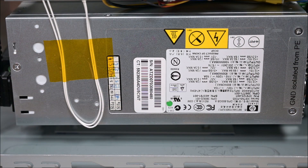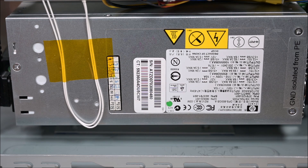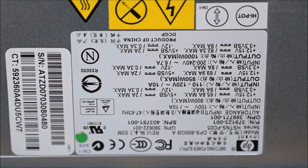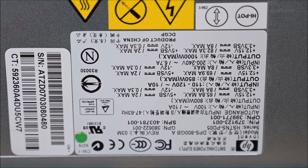The heart of this power unit is based on four HP server power supplies, each providing a bit over 12 volt and 82 amps, which is 4 kilowatt. Because the power supplies are connected in series, the output voltage will be around 50 volt at 82 amps.